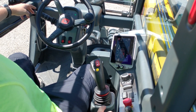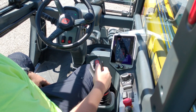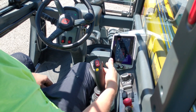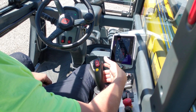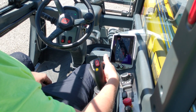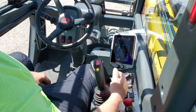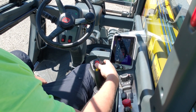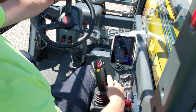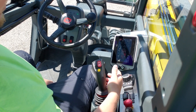Now, this is not like other forklifts with the forward and reverse on the column — this forward and reverse is right here, it's this red switch. Before you can do anything, there's a dead man switch on the back of the joystick that has to be pushed in. Push that in, go to forward — and reverse, you'll hear it beeping. Neutral is right in the middle.